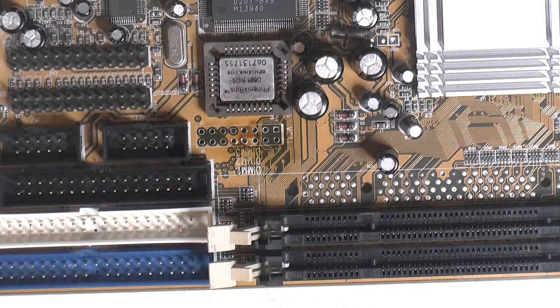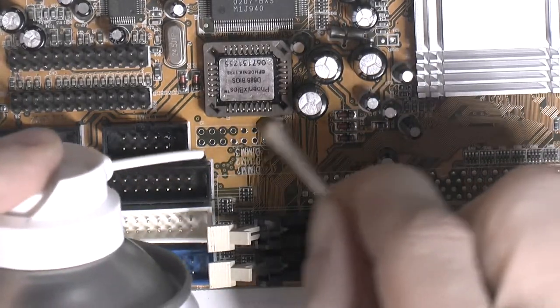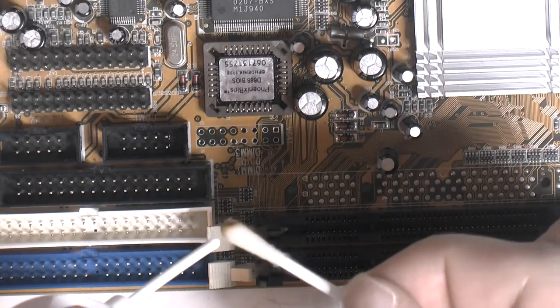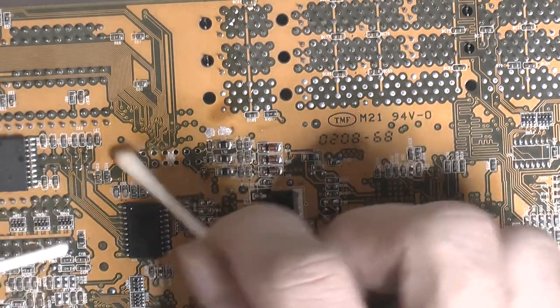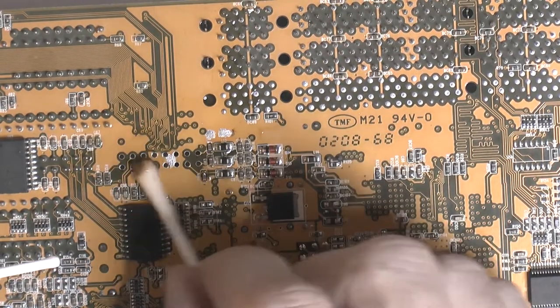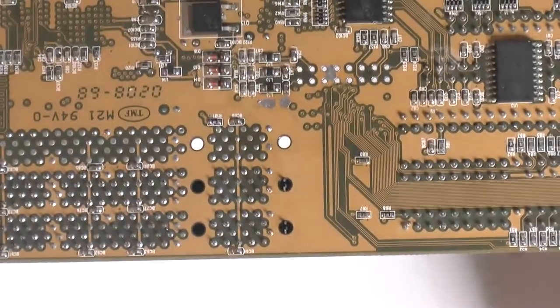And preheating it with the hot air station a little bit. You can use a heat gun or something like that, cheaper, for just preheating a little bit. I got up to like 85 C on the board in that particular area. Can probably go higher, but that helped too. So I just have to clean this area now and inspect the holes, make sure we haven't missed anything. So the holes are clean, so we can mount the header there.